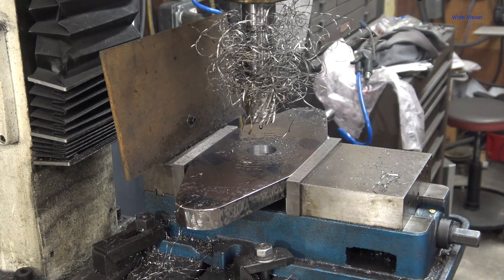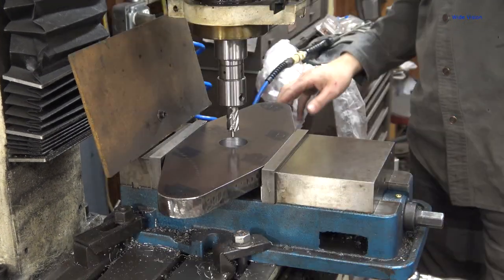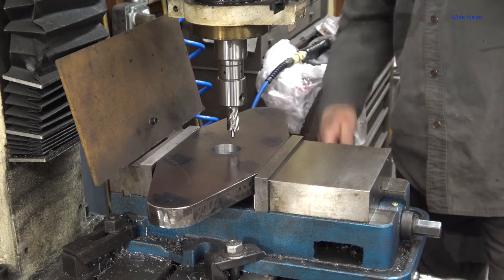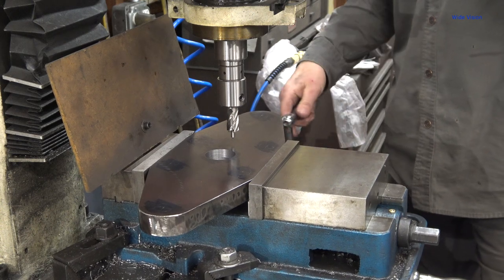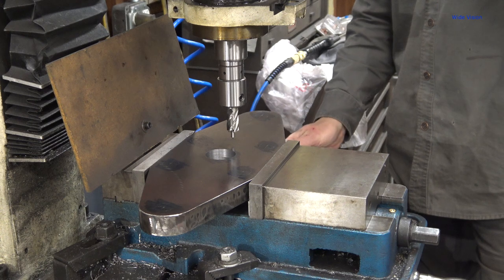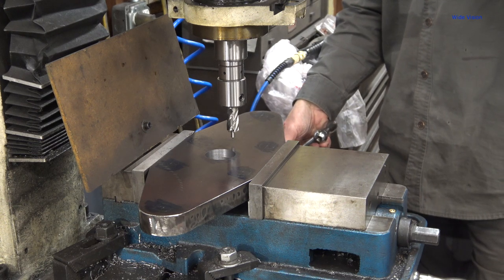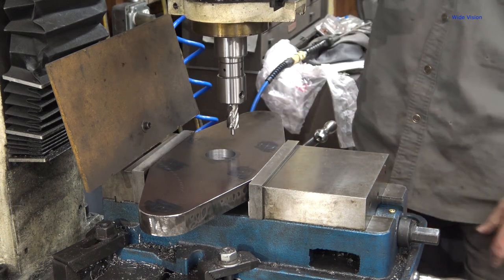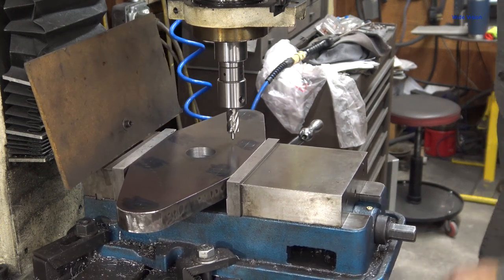Alright. Well, now I'm going to drive over to the next place. So I'm going to start over here. We'll drive over 1.875 and see if it looks right. Went too far. Take out the backlash. 5.675 on the nose. When I lock the gib, it won't be. Okay, and 1.875 this way.